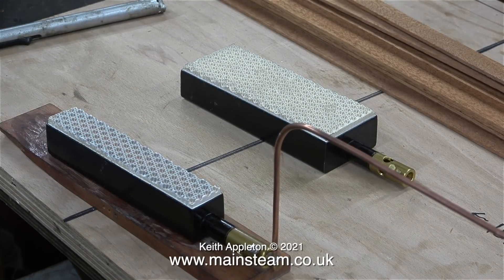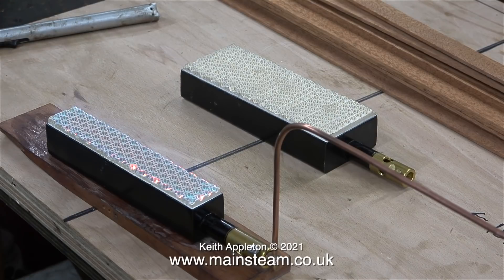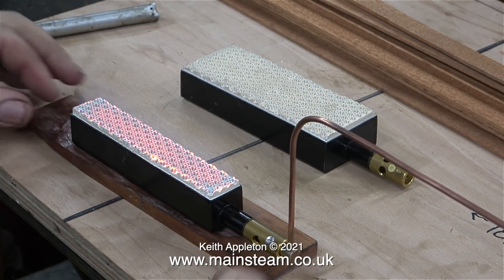In this clip, if you look carefully, you can see some puffs of white smoke coming from the ceramic. This is a sure sign that it's overheating. I'll let it cool and relight it. This time I've pushed the gas jet further into the Venturi tube, and as you can see, it's not quite as bright.